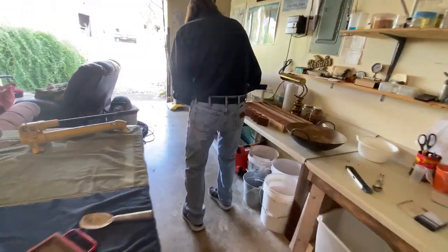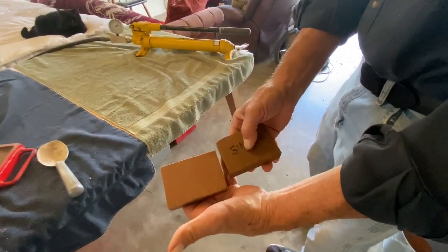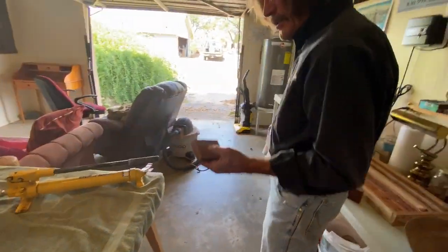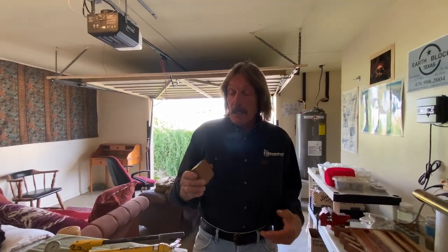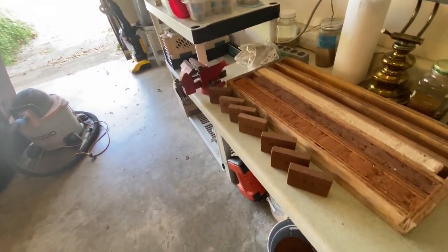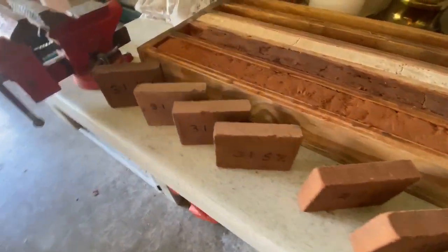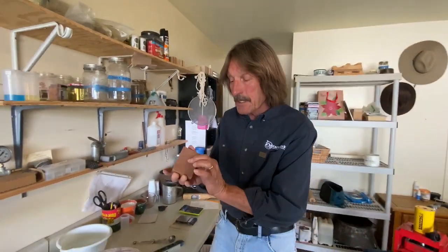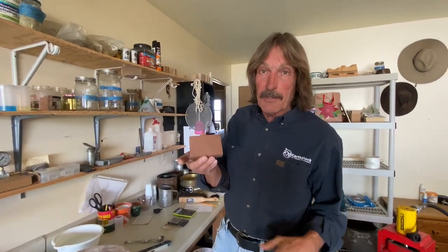You can see the difference in color here with the Portland cement versus the lime — obviously a little lighter because it's white instead of gray. This will have to cure for a couple of weeks before it's actually done. Lime is a longer cure than cement. The ASTM standard for cement is 28 days, same for lime. But with our cement stabilized blocks, they're hard enough and cured enough, typically in a week to ten days depending on temperature and humidity, to lay in the wall and let them finish curing. With lime you really want these blocks to cure completely before you take them out. I like to say: put them in a cool, dark place and let them dance for a month and they'll never divorce. If you take them out early, you might have marital problems.